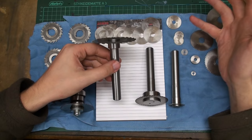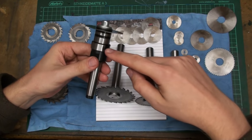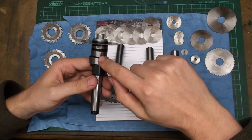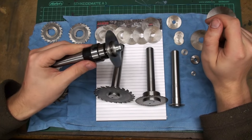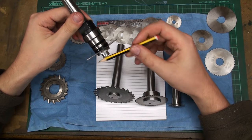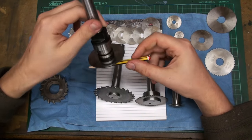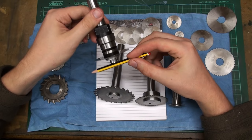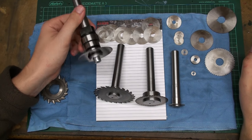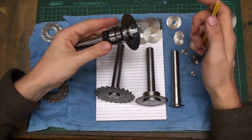What I really wanted to talk about are the arbors for the slitting saws and the wheel cutters. You can use a slitting saw and just put it onto a normal combination or shell mill arbor when you use enough distance rings. But the problem is when you have to work close to your vise, you have some rings and maybe a big washer and a screw head sticking out from the saw blade, and you can't get close to the vise. Most of the time your setup requires getting close to the vise, so often this doesn't work. If you have enough clearance it works perfectly fine.